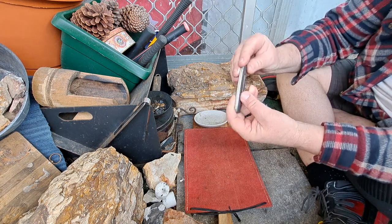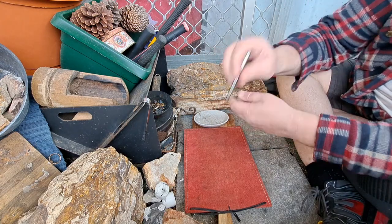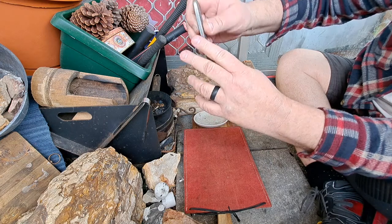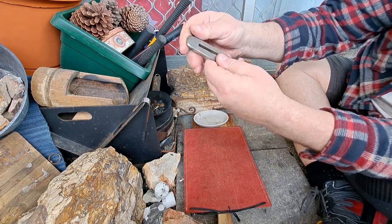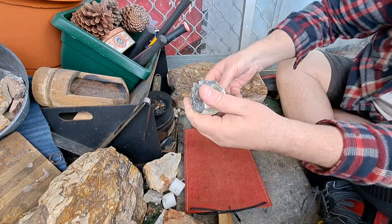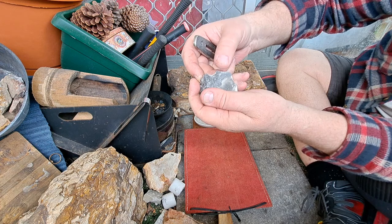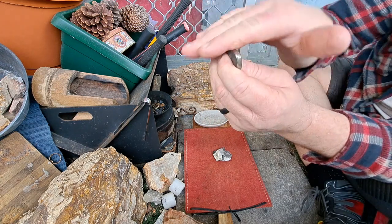Then you have to grind it all the way around — clean it all up, decarb it by grinding. Dip it in water all the time just to make sure it's nice and cool. See how I've got these nice curves here — that's for this action, that gives it a good thing. Clean it all up all the way around to give it a nice user-friendly finish. Also make sure you clean up the edges here so that the teeth don't touch as you're sparking — your teeth aren't touching the stone — because what it'll do is prematurely chip the edges.